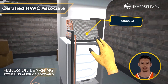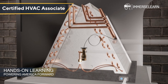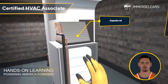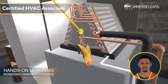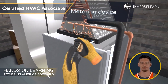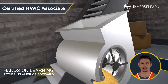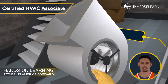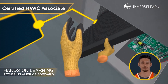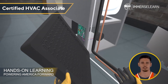Let's take a look inside. First, we find the evaporator coil. This coil absorbs heat from the indoor air using refrigerant, and like the condenser coil, is made of copper or aluminum for maximum efficiency. Next is the metering device, which regulates the refrigerant flow by lowering its pressure. The blower fan is another key player — it circulates air over the evaporator coil, ensuring the cooled air spreads evenly throughout the room. Finally, the air filter keeps the air clean by trapping dust and other particles, enhancing air quality while protecting the system.